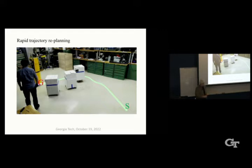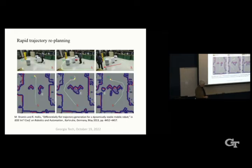This green line on the floor is an augmented reality construct. We have a camera mounted on the wall, and we can plot anything on the floor. So these are just pictures off of a monitor. So it's a little bit like the yellow line of scrimmage in NFL football. The players don't see the yellow line, but we watch it on TV, we see the yellow line. So it's like that. So then this just shows the overhead view. Red is the LIDAR returns, and the blue is the expansion of the boundaries and so forth, and again up here, okay.